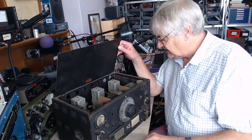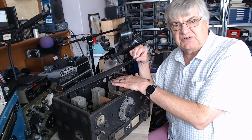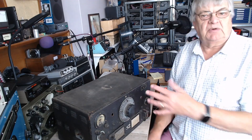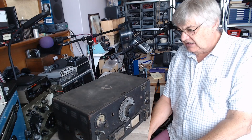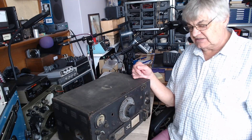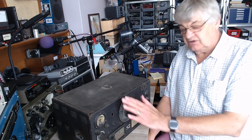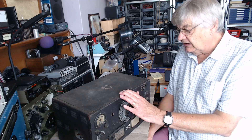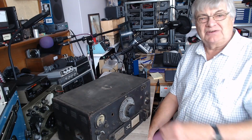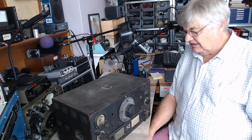So we're getting somewhere at last. I don't know about the rest of the valves — I've got to check. I've got to check the wiring on each valve base, see where the grid leads have gone, the top cap leads, see what's happened to the base wiring. Has someone changed the connections on every valve base? If that's the case, that's a nightmare. Because I did put HT and LT onto this, and not a hum or buzz or crackle or anything in the speaker. Well, it wouldn't — for starters, there's no audio output valve, and secondly, the audio output transformer isn't connected to anything apart from the chassis.